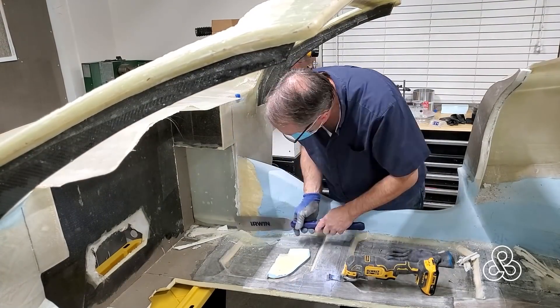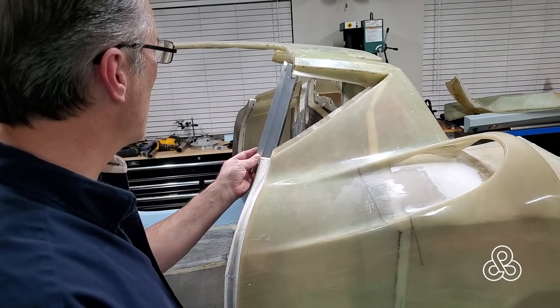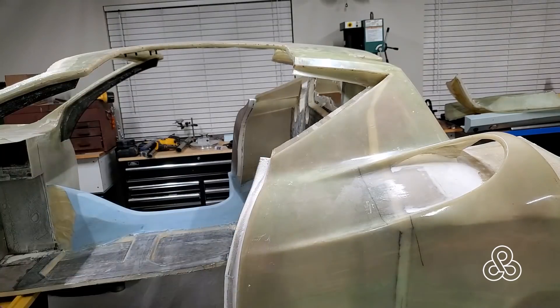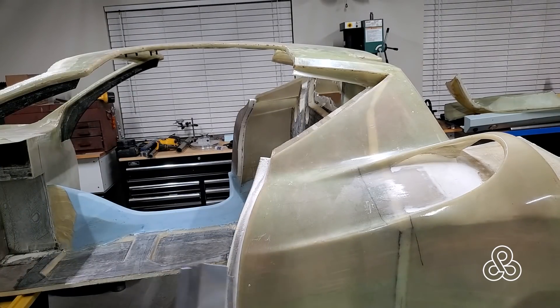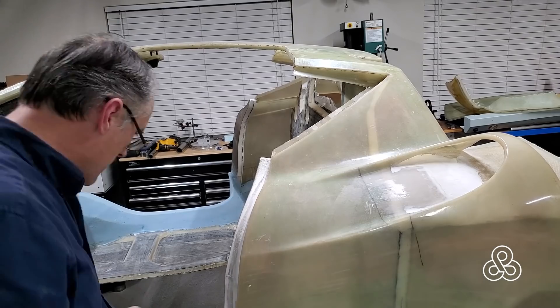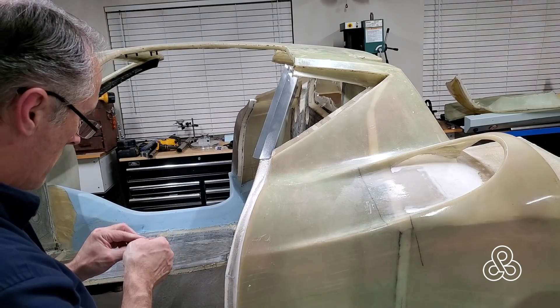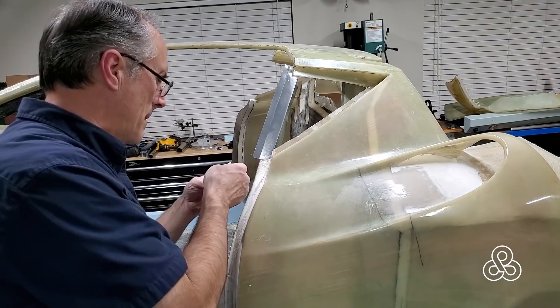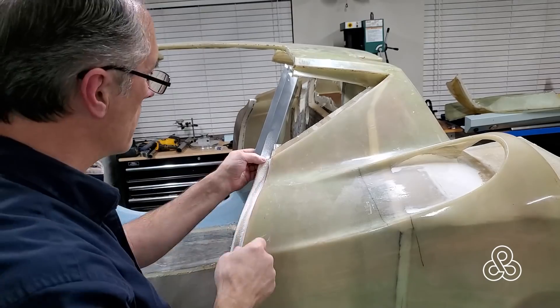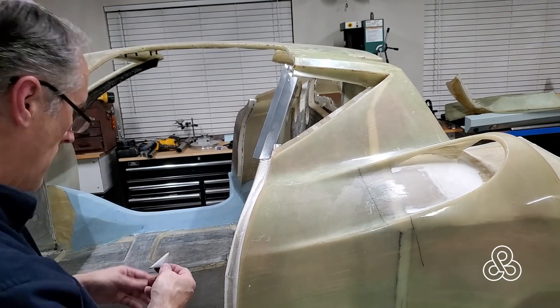Using our little oscillating saw, we clean that up. To build this bulkhead and flashings for our weather seals, I'm going to use some aluminum flashing used in roofing. It's easily trimmed with heavy scissors or tin snips. I've taken it out to the brake and given it a couple of bends — one bend makes a little rain gutter, and the other is a 90-degree bend that turns back, giving us some strength and stiffness.